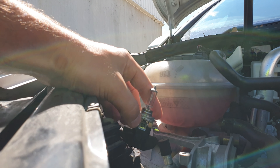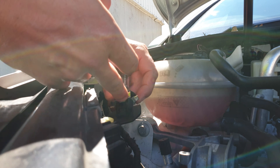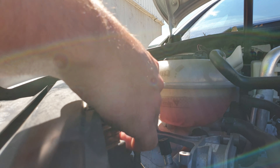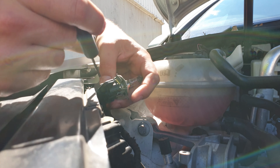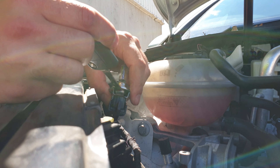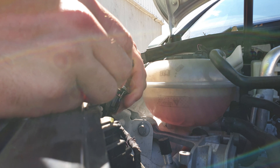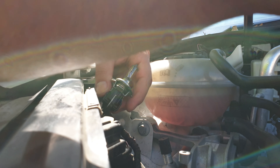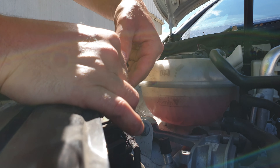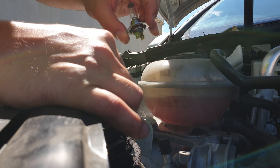How do you take this light globe out? You pull it — there are clips there, but you don't know where to pull it. It's actually in there quite firm. So you just grab your keys and put them in between there — this is why you want the light off. Just give it a bit of a twist to help free it, keep doing it, and then once it's free and there's a bit of gap, you can give it another yank and it pulls out.